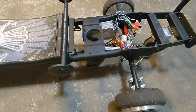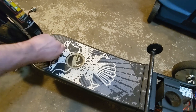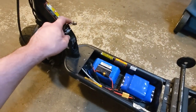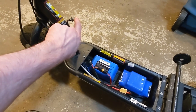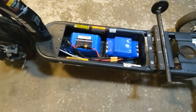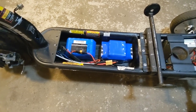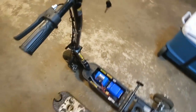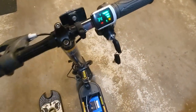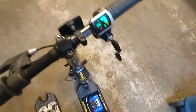Let's take a look under the battery cover — the footstep. I don't really have a nice situation for the charge cable; it's just the original hoverboard charge cord, so I can use a regular hoverboard charger. Inside there's room for two hoverboard batteries, so I have a Y cable running them in parallel — still 36 volts, but enough capacity to get me a few miles. And the throttle — let me turn this on. I'm still using the original hoverboard switch as a main power switch. The battery indicator works pretty good; it's set up for 36 volts so it actually tells me the battery condition. You just give it a little twist and she goes — let's go for a ride.